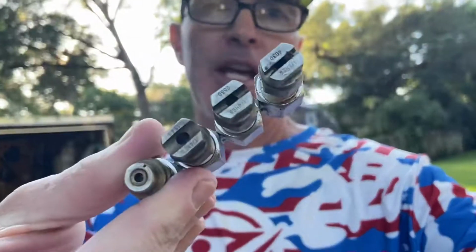Now, the previous video of the same house, so you can see what it used to look like. We did this with the X-Jet, but primarily what we used was a reducer off the end of a high pressure ball valve, and then the J-rod with wash tips. And the reason we did that is because, basically when you lay your chem, you really don't need high pressure on bricks, and I'm gonna show you why.